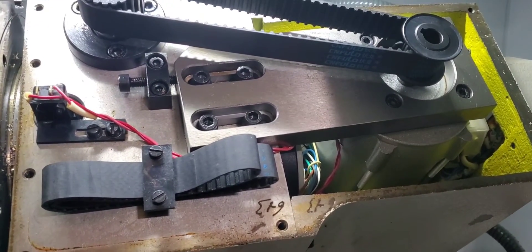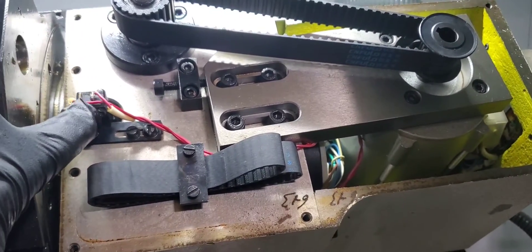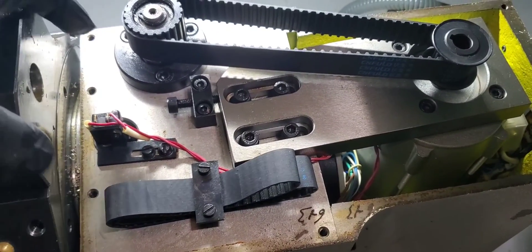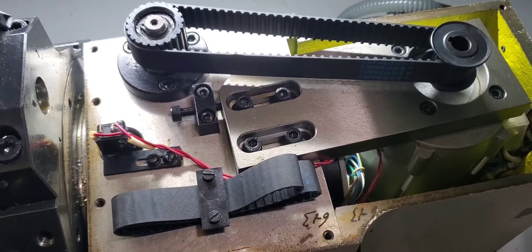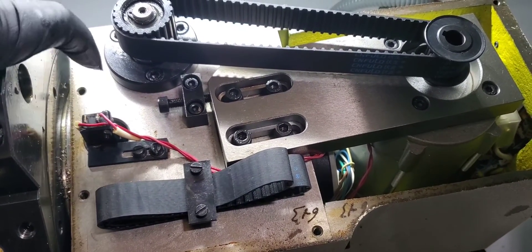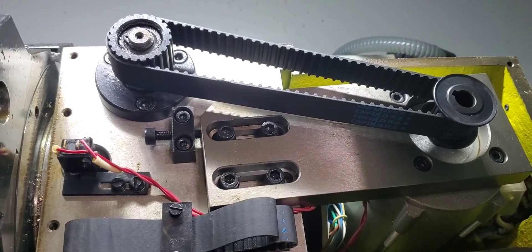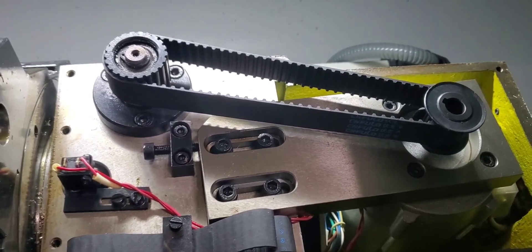You could take the slack out with an adjuster, but I ended up just putting the old belt back on because it wasn't going to be the issue. I believe this is either the lock sensor or the tool change sensor — it comes around and clicks a switch every time a tool passes by, and when it gets to where it thinks it needs to be, it reverses the motor and backs up. Anyway, thanks for watching — shout out to Tormach for hooking me up this time!